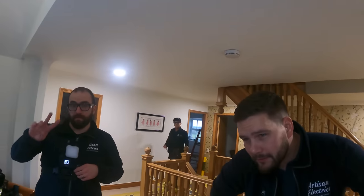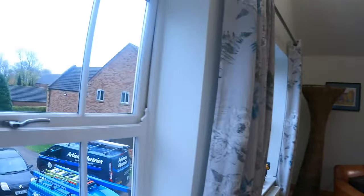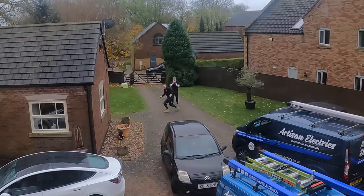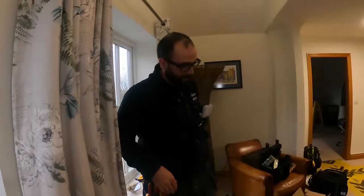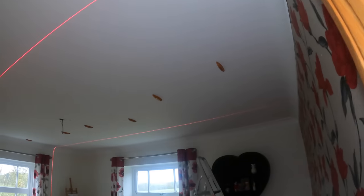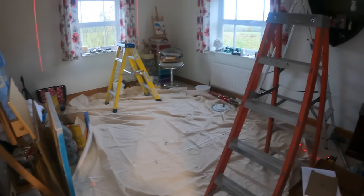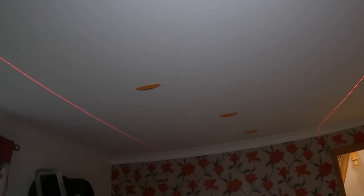All right, good morning, guys. Get Jordan out there. Luke and John and Ruben. So basically, as you can see, old boss man's turned up, doing a solar survey. John's gone for chest cam. It's Tuesday, week two. We've got all the stud buddies up on the ceiling showing where the joists are. John's just setting out the lasers, dust sheets down. They're great just for chucking on the ceiling and easily being able to see where your joists are. Then you can make a bit of a plan where to space your downlights.